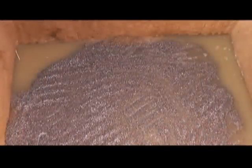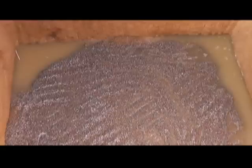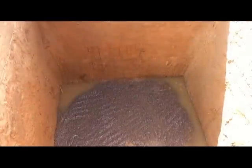The pea gravel also provides a way for drainage out of the manhole. In the bottom of the manhole they have a hole that is called a sump, and any water that enters into the manhole will drain out through the sump. All we need now is a manhole.